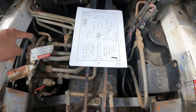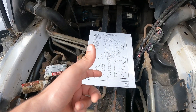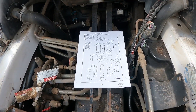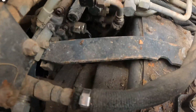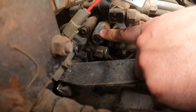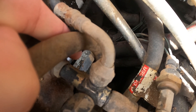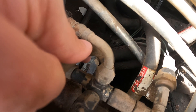His suggestion: take out the lift and take out the tilt and flip-flop them. If the problem goes away, then you know the seals are bad on that valve. I like this idea — it doesn't cost any money. The one I'm after is this one right here on the front; I believe that is my lift. And then on the back, this one way back down here — that's my tilt. So I'm going to work on taking those out and flip-flopping them in.